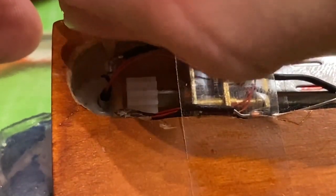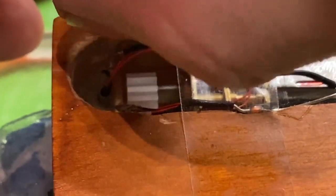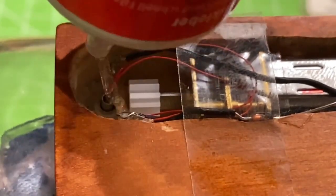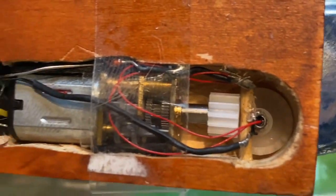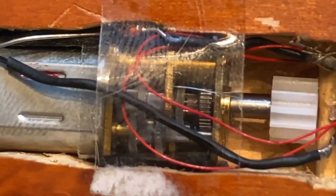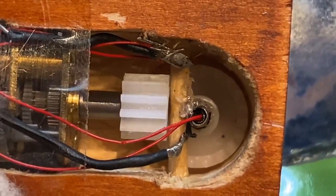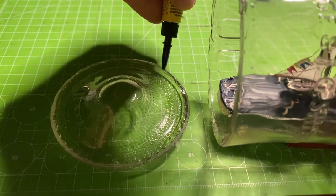And so I put in this little piece of wood as a truss. Fixed it to the rest of the stand, which was of course also wooden, so that made it pretty easy. And once that was dry and secure, I got some basic glue once again to the cable tube to make sure it's not rotating and the cables never get twisted, or at least not too much. And here you can see the tube is fixed. The 3 millimeter tube is obviously turning, just as those gears are. And this is the final assembly.